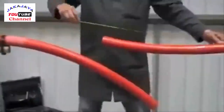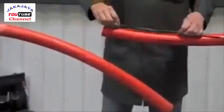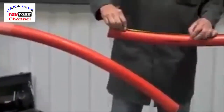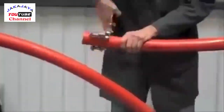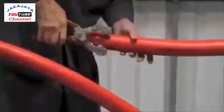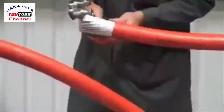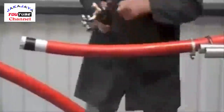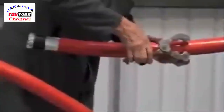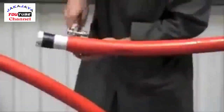Make sure you study the installation instructions supplied in the kit and using Table 1 and Figure 1, mark out the outer cable jacket. Using a suitable tool, score the outer jacket and remove as shown.